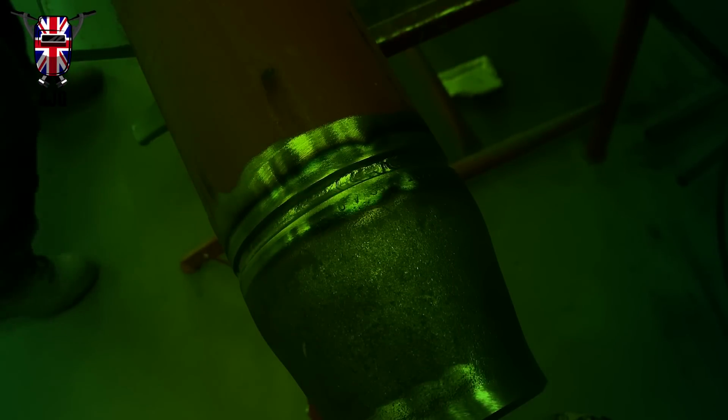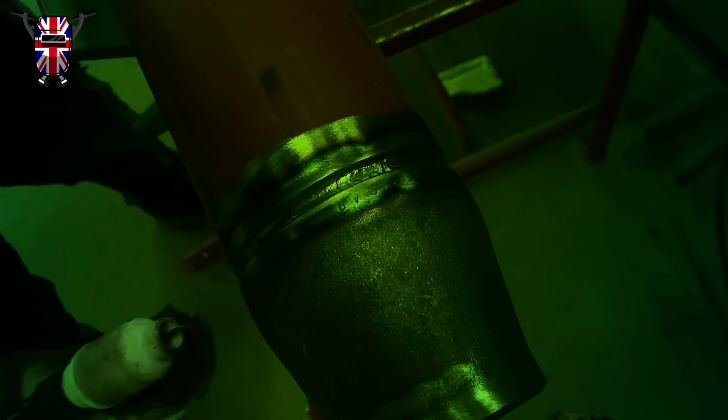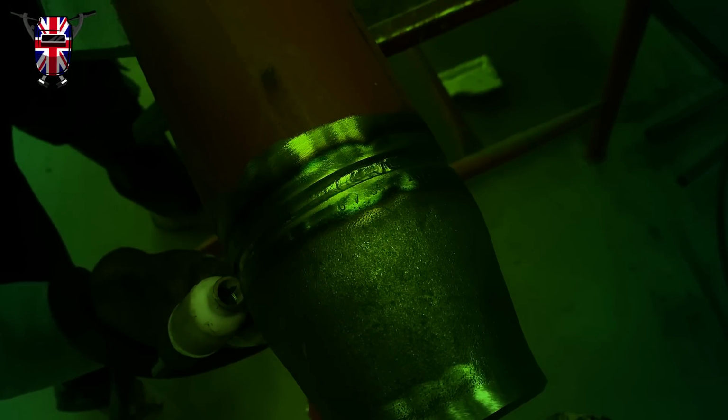It's always good practice to clean off a weld when you're done with a wire brush or a wire grinding wheel. You don't need to use a grinding wheel. It's not stick. You've got nothing to clean out of it or anything like that. It's all the same going all the way around, so you haven't got to even it up or anything. And then usually you could leave it 5 or 10 minutes, but I'll just get straight onto it. With the same amps, I don't really turn it up when I'm doing this fill pass or hot pass, whatever you like to call it.